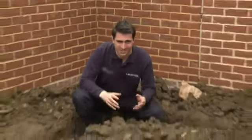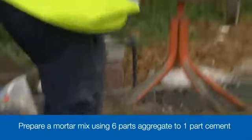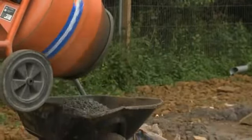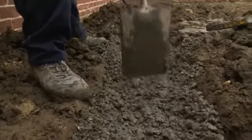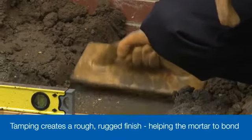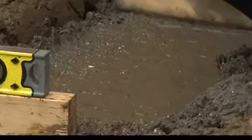To create the concrete for the footing, we're going to use a 6-to-1 mix — that's 6 parts aggregate, sand and gravel, to 1 part cement. Mix the sand and gravel first with just a little water, ensuring the cement is evenly distributed throughout before adding extra water. You need a fairly wet, pourable concrete so that it flows into the trench footing and is easy to level out. The concrete is simply poured into the trench, spread using a shovel, and roughly leveled out, before being tamped with a length of timber or a float trowel to expel any air pockets. This also creates a rough, rugged finish that will be an ideal base for the mortar to bond to. Ensure that the concrete is flat with no slope or fall in any direction, and leave it overnight to give it a chance to harden.